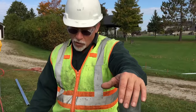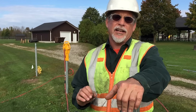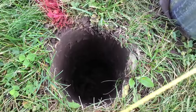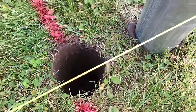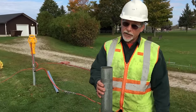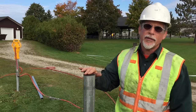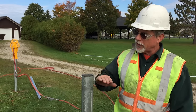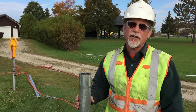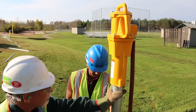In this job here, we're doing about 300 feet of fence and it's pretty rocky. You can tell with the three-inch post here — we pounded it in this location and hit a rock, so we had to move the post. You can also tell it's harder soil because this is all SS-40 pipe and we're actually mushrooming it a little bit. We'll probably have to cut these off to get the cap on, but that's just showing you the real tough conditions — it's hitting them hard enough to mushroom these tops.